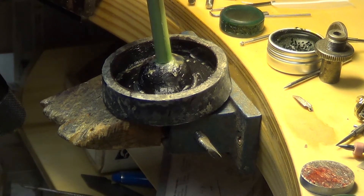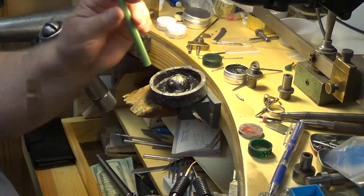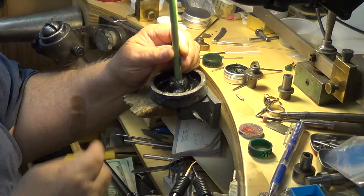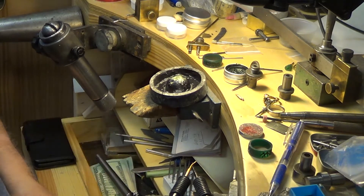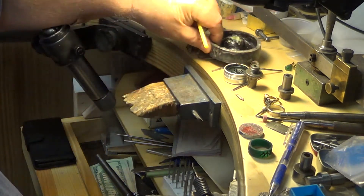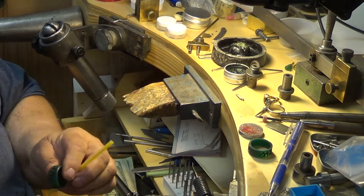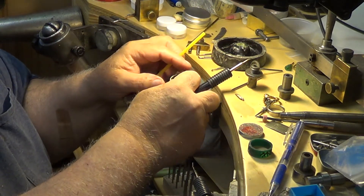You would go ahead and sprue it on here like that, put your base on, and then you'd have sprue bars coming up all the way up the sides. You could probably put a set of five different rings going up — so you can cast a lot of rings in one shot if you have the equipment. What we're going to do here is use this sprue bar, and because this is silver I want plenty of silver flowing, and hope that it casts right.